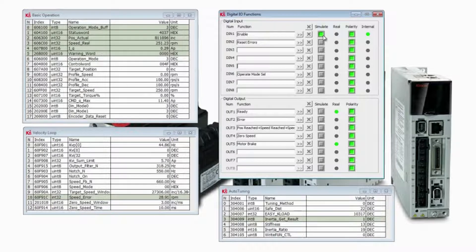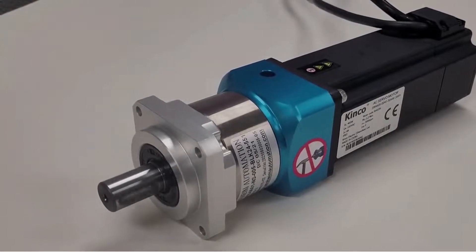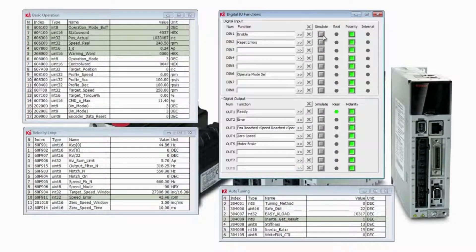I can tell there's a little bit more vibration in the motor, a little bit more of a wind to it, and that's because I did drop out the KVI. What I want to do is increase this KVP value, increasing it by about 5 Hz each time. These are going to round because it's a decimal — a DEC value that is converted into Hz in the software. So even though I hit 50, it's 50.02. I want to run this until it runs fairly smooth and the gains are appropriately smooth. The overshoot could be fine, because that will be tuned out by the KVI value.